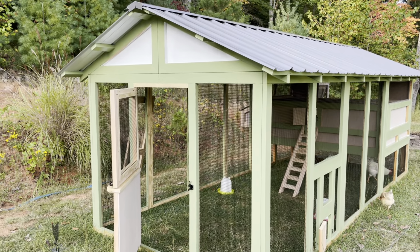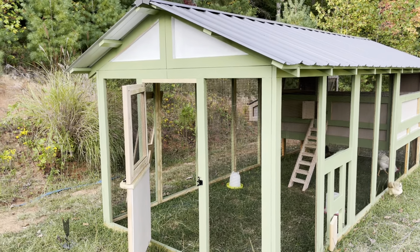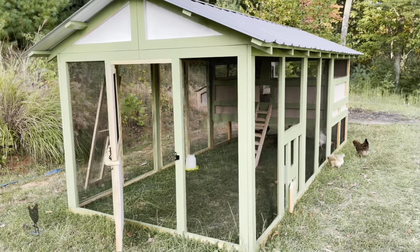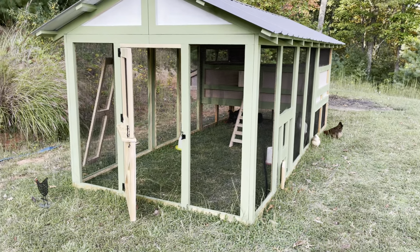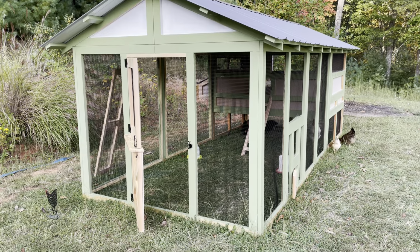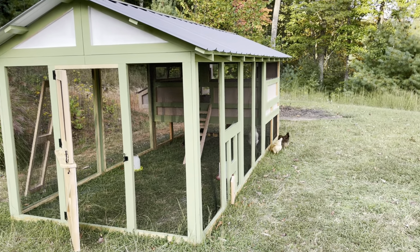Obviously we got more to paint. Some things did get repainted, put some caulk down since the last video. And then we've got a friend of ours that says, hey, when you're all done, I'll help you raise it up so we get it off the ground. And that's another thing we definitely would redo, is pouring a concrete footer all the way around, just on the perimeter, not all the way across. And that would also help with leveling it better. It's close, but it could be better.